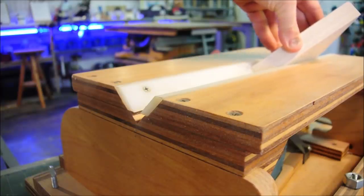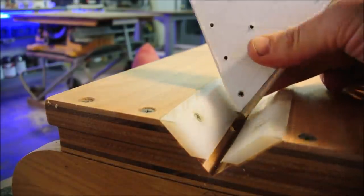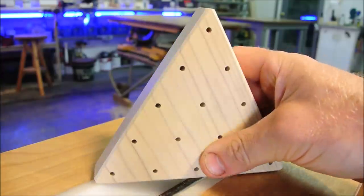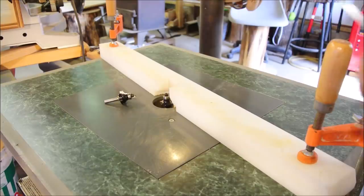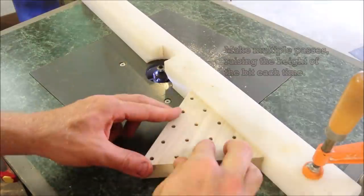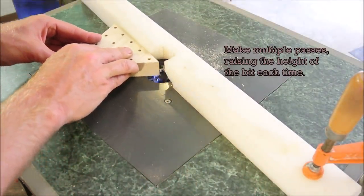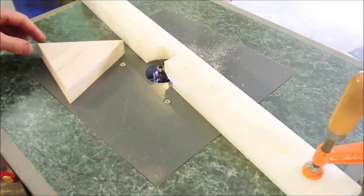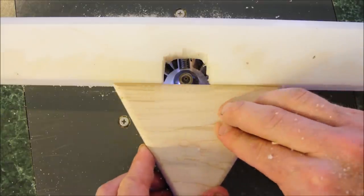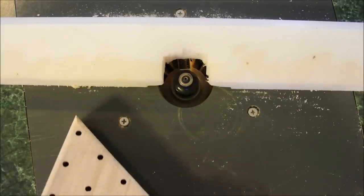The woodworking here is pretty basic, so we're looking to fancy it up a little bit, and one great way is to chamfer all the edges. But another thing that looks really nice is to give it a simple round over. There are two key variables to remember. Ask yourself, is the bit spinning at the correct speed? And is the bit sticking up out of the table at the correct height? If you can balance those two things correctly, you can make perfect routes.